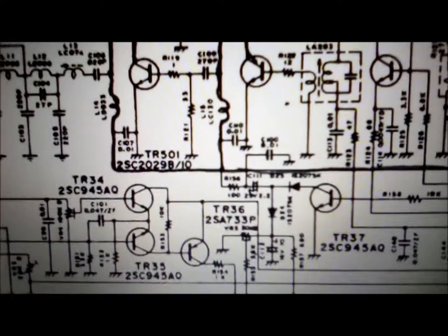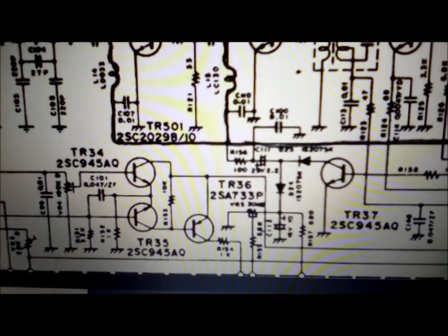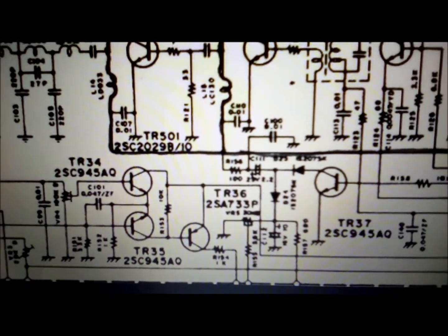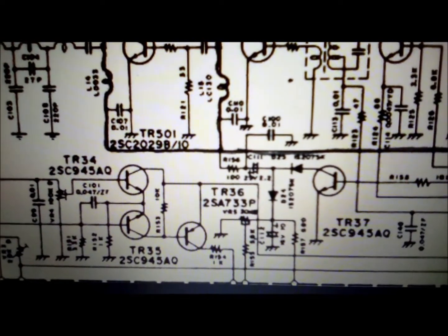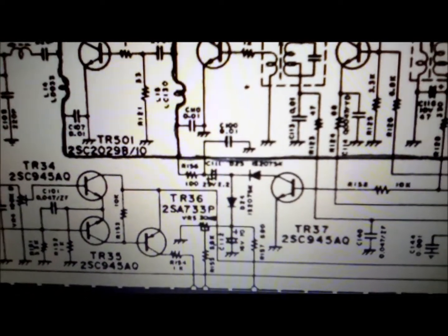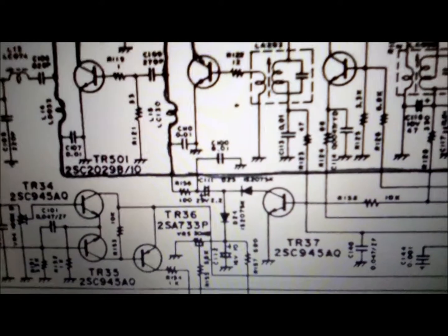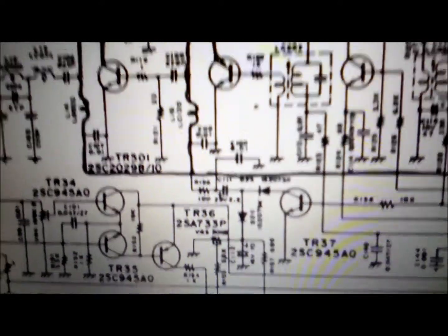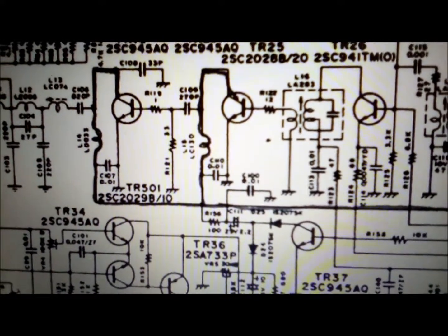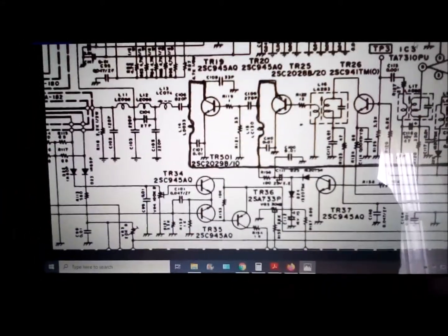I really didn't know if changing that resistor would do anything, so I took one leg out and when I did that I had no modulation. I tried about 800 or 1000 ohms and it seemed to lower the output, so I went the other way and found that 68 ohms raised it up a little bit. That's pretty much all I did mod-wise - I don't know that you can do a whole lot on these. Hopefully this was informative.